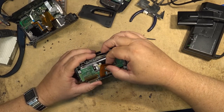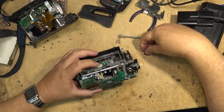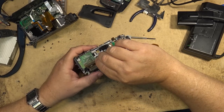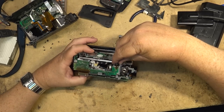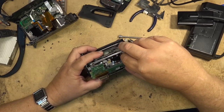drum. The head drum plugs in. There's a connector right here, and there's another connector right there. And what happens is these connectors, this is what transfers the video signal over. The other connector for the drum motor is over here. We remove this connector here, and remove the loading motor connector up here, we can actually unplug this board, and this is the other connector to the drum.